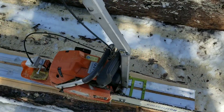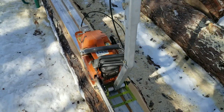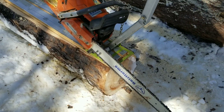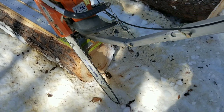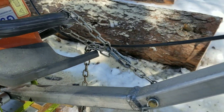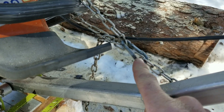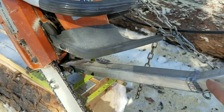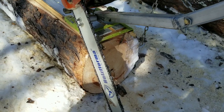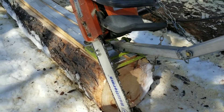Now the key to getting the angle right — when I tilt my handle, the saw tilts down. That angle is set by this chain. All it is is a chain bolted to the arm that wraps around the holding handle, and I have something similar to a carabiner clip so I can set that angle to what I want. It's maybe 45 or 60 degrees or so, and now I can start the saw and walk it and push it right through.